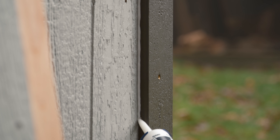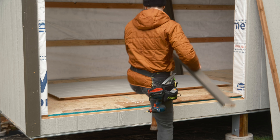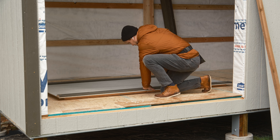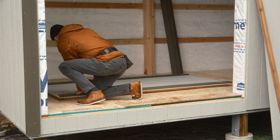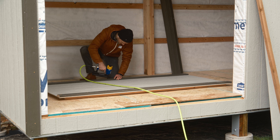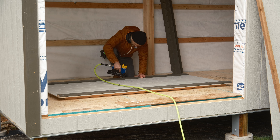This is actually the stuff that froze and cracked on me — I guess now we know it was DAP caulk, sorry DAP. To install the trim on the doors, I made sure to use screws on the sides that would have the hinges installed, and I made sure that these screws would go all the way through the trim, through the siding, and to the frame in the back so they would make a strong connection. Using some brad nails worked perfectly fine for the rest.